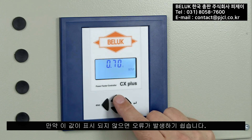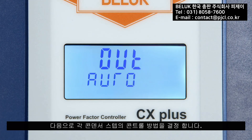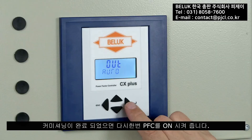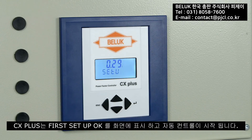Now the types of each output of the controller are set. These can be set to 'Fix On', 'Fix Off', or 'Automatic'. Commissioning is completed once again when the power factor control is switched on — PFC On.